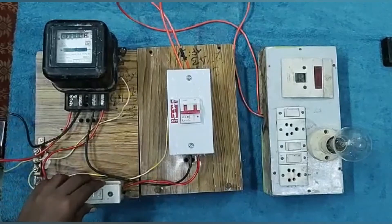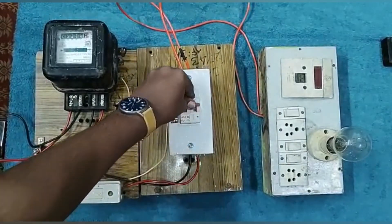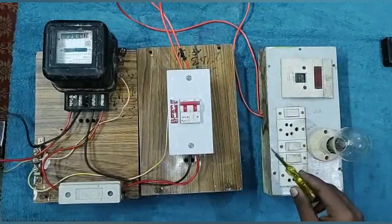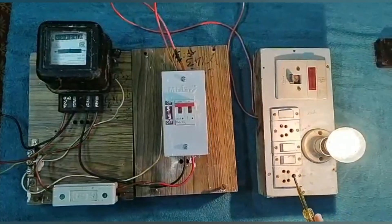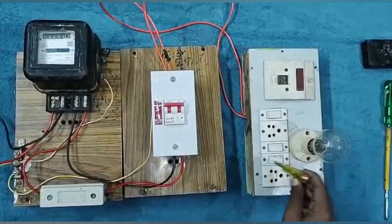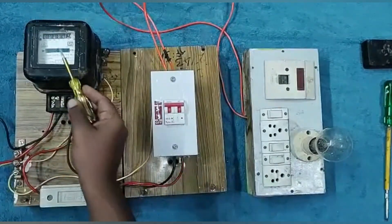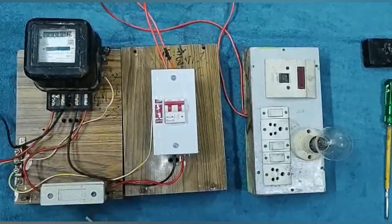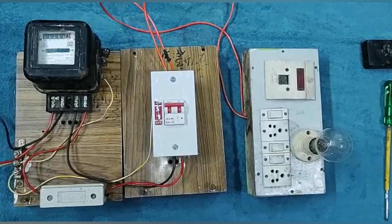Now I am placing the fuse carrier into the base. Let's turn on the isolator. Now let me turn on the load — we can see that the bulb is glowing. When the output load is connected, the aluminium disk will start to spin slowly and the reading is observed through the dial in kilowatt hours. That's all for today. Hope this video will be useful for everyone. Don't forget to like, share, and subscribe to my channel for more interesting videos. Thanks for watching.